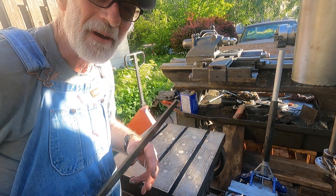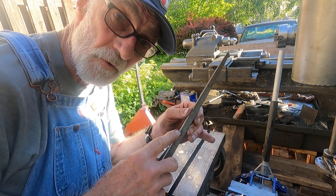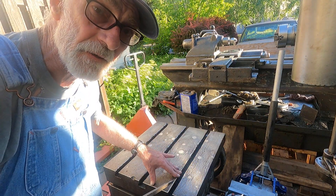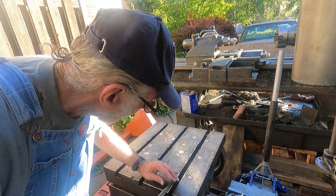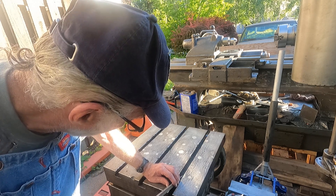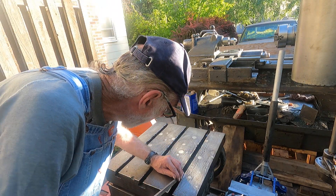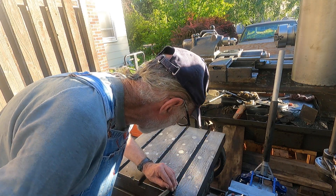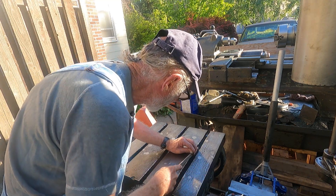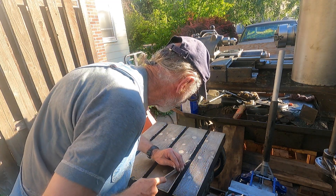To kind of cover that up, the trick is to go back to the old file. I've got a pretty aggressive tooth square file, and I can make that look quite a bit better. I'll hold the file so it's kind of down in the slot at about 45 degrees and try to get a little contact on here — it should smooth that over. I don't want to go across like that and scratch it.